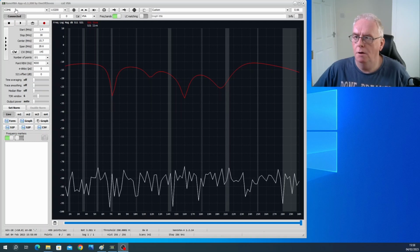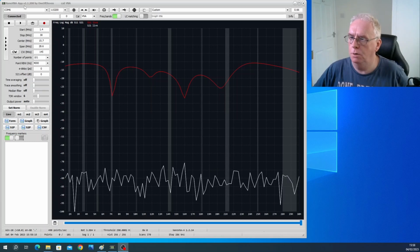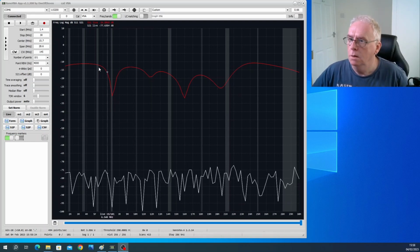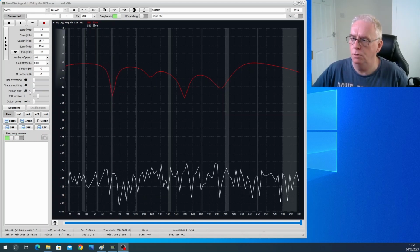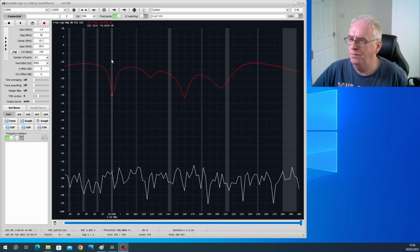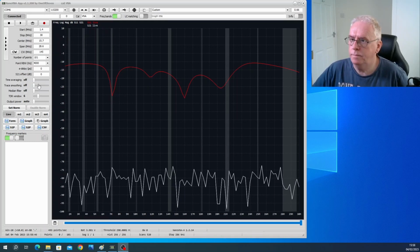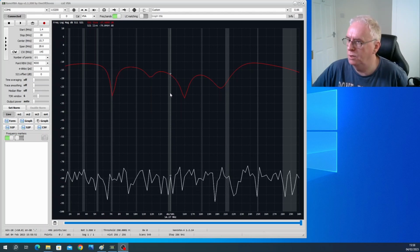So I also managed to get the NanoVNA app going that is on the NanoVNA website. Had a little comms issue with it before. I thought you'd like to have a look at it. Please excuse the one on the bottom, I can't turn it off. That's S21, which is just noise. This is showing the response in decibels. I need to do some work on this and find out how to use it. But you can see that the SWR, which no idea why it's being measured in decibels, is optimised there. It's not too bad at 14 megs.